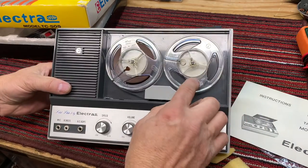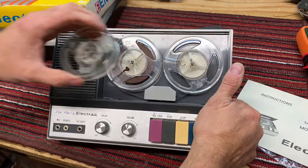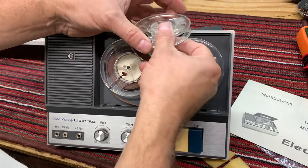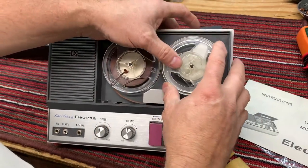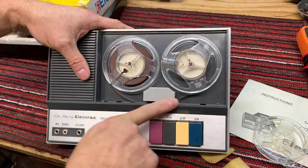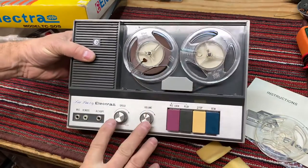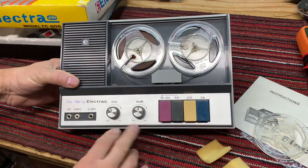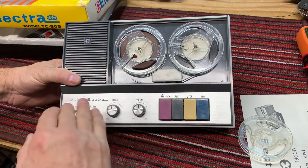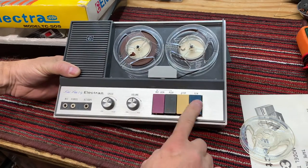It's got these big reels, and by that I mean they're a full 3-inch, I guess, compared to these, if you see the difference. Also see the size of the inside spool. It's quite a bit larger, which means the tape is going to travel through here more quickly, so it'll run a little faster. And if you record it on this Electra, the quality of the recording would be better because it's more tape running through and passing through the heads. It's got a speed adjustment here, volume control, and it's a keypad